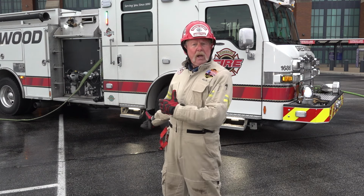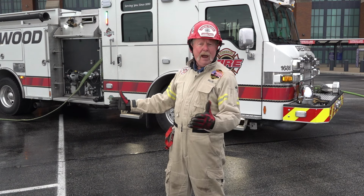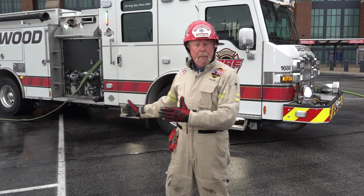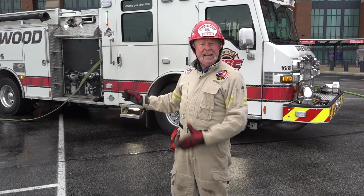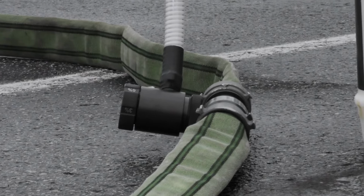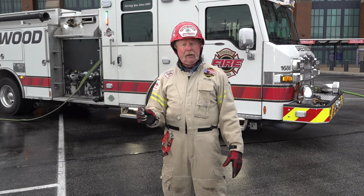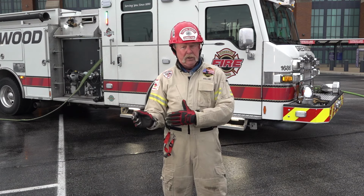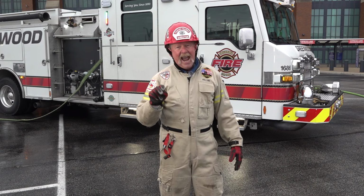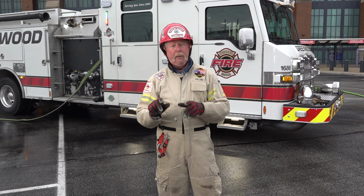We have a pumper of sufficient pumping capacity to supply our system that we may be using to cover this area with foam. The pumper is going to be, in this case, pumping a 1.5-inch line to a foam eductor, an inline foam eductor. Some of those eductors accept a 2.5-inch intake line, and others a 1.5-inch line, such as this situation. With that said, we want to pump 200 psi at the eductor. That's what you need, 200 psi at the eductor, for the system to work properly.